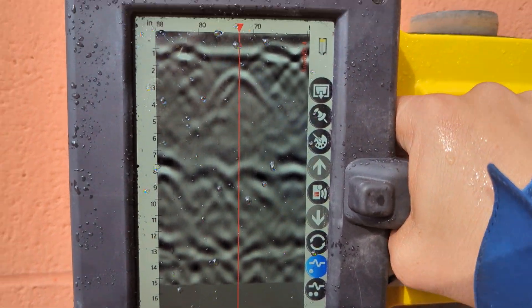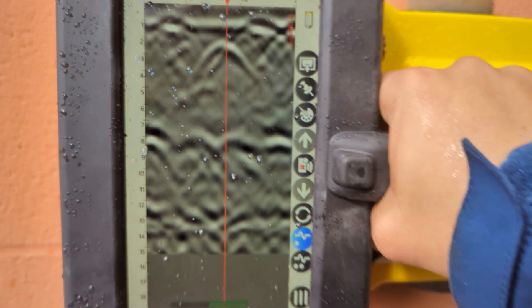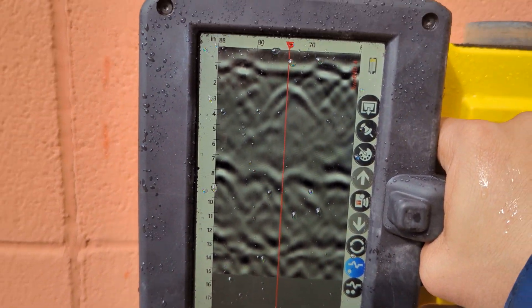For this system, the red line is actually located to the front of the GPR right here — it's not off to the side like many others. It's right off to the front, and so that's a great indication of a filled-in cell with reinforcement.